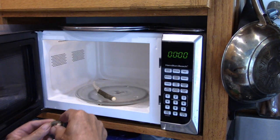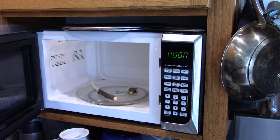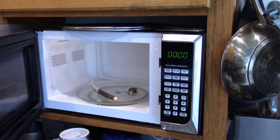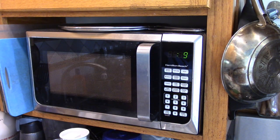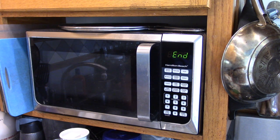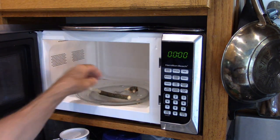The reason wood cracks is that as the wood dries from the outside, it shrinks — so it's drying around a larger interior volume, and that shrinkage is what pushes the crack. The microwave is heating from the inside, so it's heating all the wood uniformly. Boiling will do the same thing — you heat the entire piece of wood, boil it for a good while, and the moisture wants to evaporate, pushing it from the inside out. I've done that successfully.